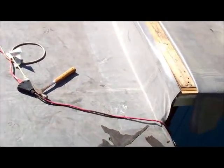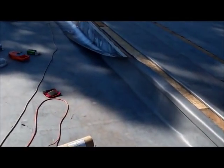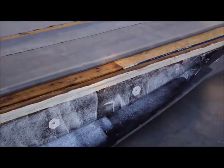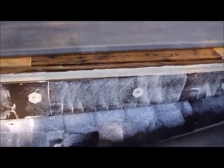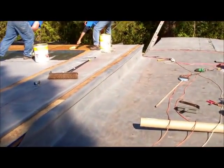Since we've got a transition right here, when we cut this piece of rubber, we made sure we cut it long in this area so that we could put it up and be a solid piece. So now we are putting the glue on and then rolling that up the wall. This particular white glue here has to turn clear — you can see it's milky white right now. We have to put it on both sides in order to go up that wall so it sticks, but it won't stick until it turns clear. Down there was in the sunshine, so it turned clear a lot faster.